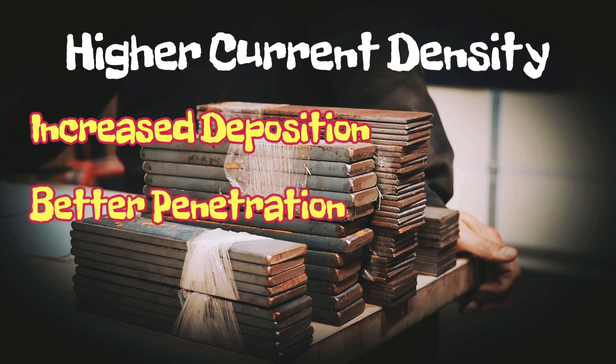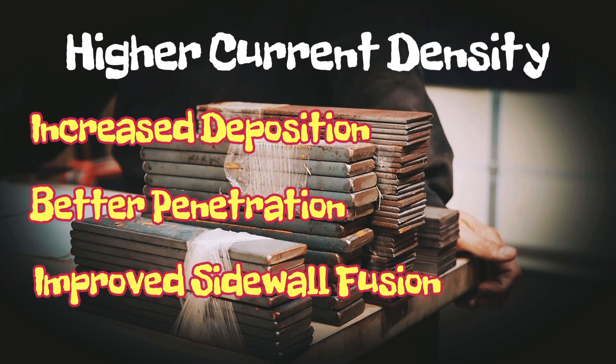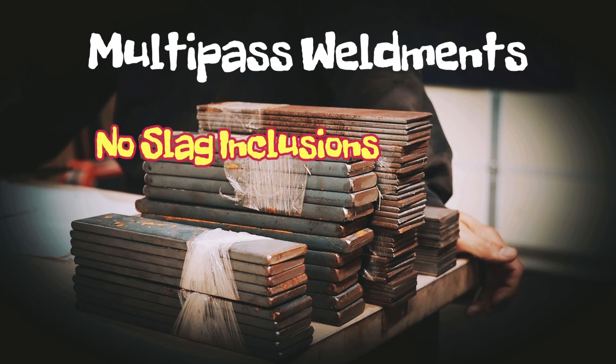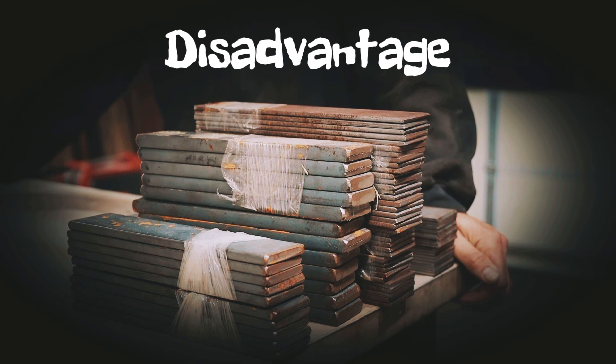Another benefit to metalcore is better penetration in the root. If you're welding thicker gauge stuff or based on your code, and you're looking for better penetration profiles, metalcore provides better penetration and also sidewall fusion. When talking about multi-pass welding, post or pre-clean up is less critical because metalcore has fewer silicon islands, so you can weld right over. If you have dirty material or mill scale, it gives you similar qualities to flux core where it won't disrupt the arc.